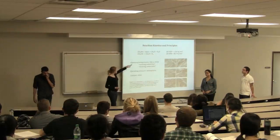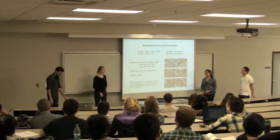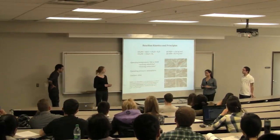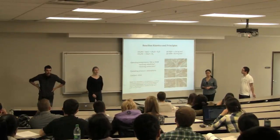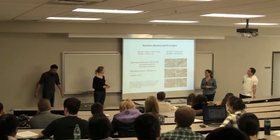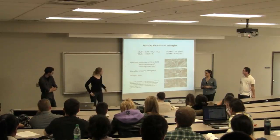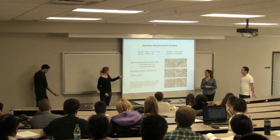We are operating it at about 900-950 Kelvin, which is fairly warm. At 923 Kelvin, we get the optimal conversion and selectivity of our methanol to formaldehyde. I believe it's 84% conversion and 92% selectivity, so that's incredibly high, and that's just on a single pass, so that makes it really efficient. We're just going to be operating at atmospheric pressure. And we'll be using a silver catalyst.